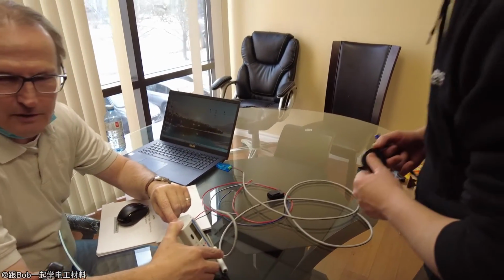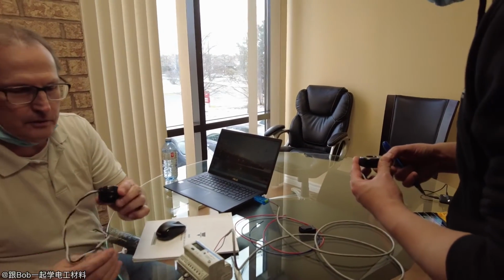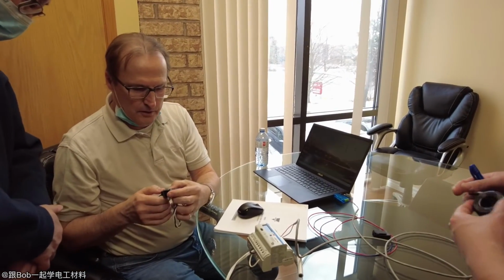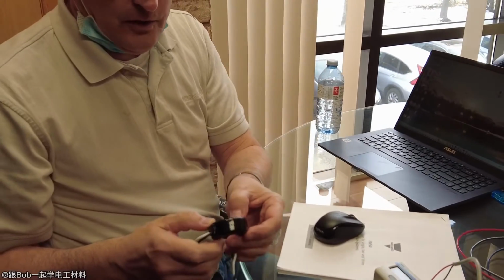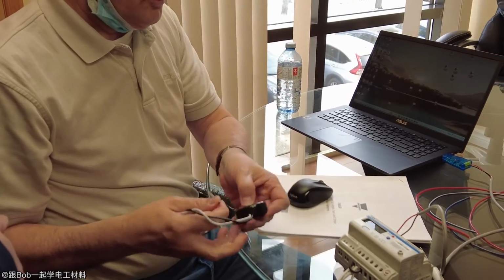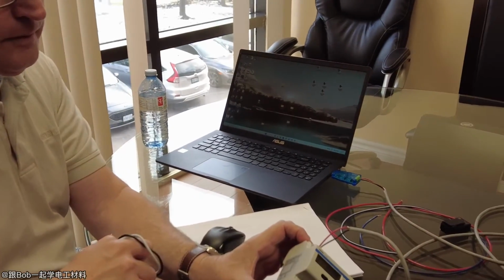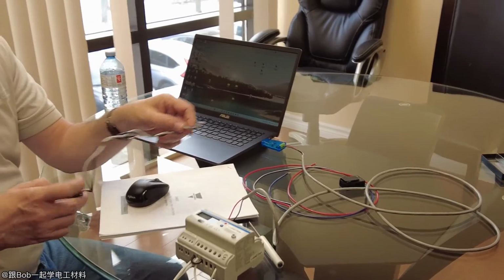Let's see if we tell you on here which is the side. You can see X1, X2 corresponds with H1, H2. So the high side here is that, and there's your high side on this one, the black wire. The black wire would go to I1. As long as it's labeled, you just wire number to number, that's it.